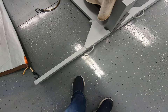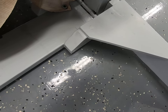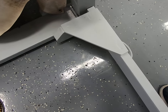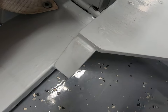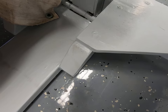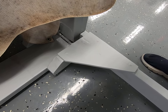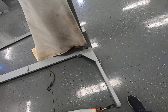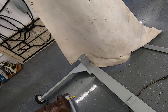Notice the way it's designed and constructed. This is exterior-grade plywood, and these are just two-by-fours. The main base is two-by-six. All of the wood is joined with glue and screws, and wherever there's a joint between two pieces of wood you want to use caulk — ordinary exterior-grade water-based caulk — so that water doesn't get in between the lumber. We also sealed the screw heads with caulk. The idea is to have this stay outside without rotting, lasting a good five to ten years.